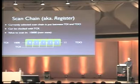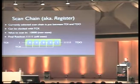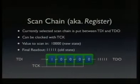Here we want to scan in the value 10000, and previously it was all 1. So whenever you shift a scan chain, you will read and write. There's no way to just read or just write. You will always do both. So you replace the content. We will tick through the individual cycles, and we see that we were able to replace the content of the scan chain with the new content we want to scan in, and we have been able to read out the old content of the scan chain. So that's the basic operation of how you operate a scan chain.